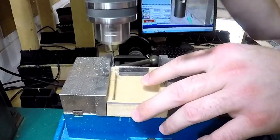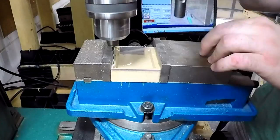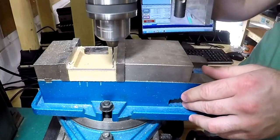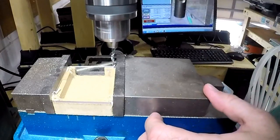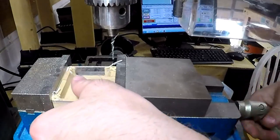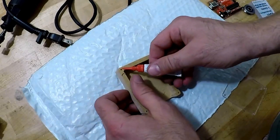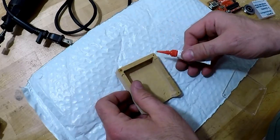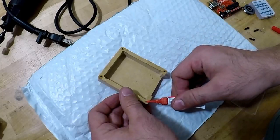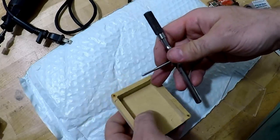I drilled the cover to fit the enclosure on my manual mill. While this could normally be done on my router, I'm using 4-40 screws and didn't have a bit small enough for the operation. Once the pilot holes were drilled, I added CA — aka super glue — to each one in order to reinforce the edges. When dry, I tapped the holes as shown here.